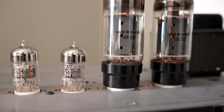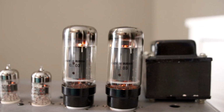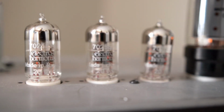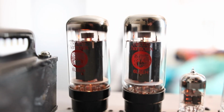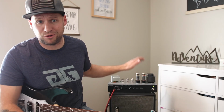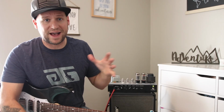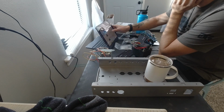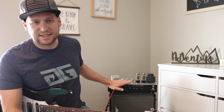Just really good, budget-friendly, but really good sounding tubes, right? So I got some 7025s in the preamp stage. That's just a 12AX7 with slightly tighter tolerances. And then two 6L6 tubes for the power section. Really good sound out of those tubes, highly recommend them. I'll go ahead and put some links in the description for those as well as a link for this actual kit.